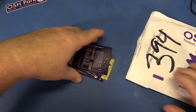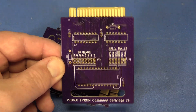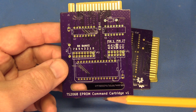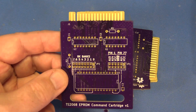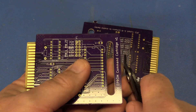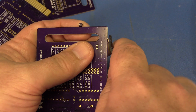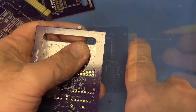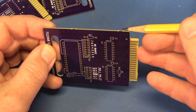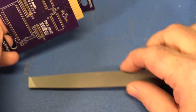Got to have a sticker. The first step is to get rid of these panelization remnants. You can cut them off or snap them off like that. Next, we want to get rid of these leftovers from the rat bites where the panelization was. To do that, we can just file it off with an ordinary file.